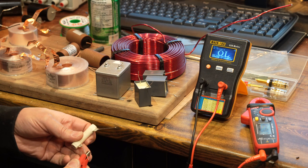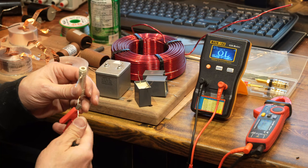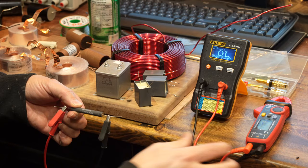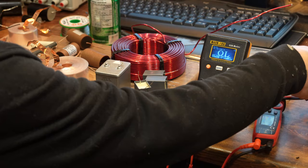You're also supposed to test your resistors — just because they say a certain value doesn't mean they are. This Mundorf resistor is supposed to be 8.2 ohms and it measures exactly 8.2 — Mundorf is usually not far off. This other one is supposed to be 11 ohms and it measures 10.8 — close enough.